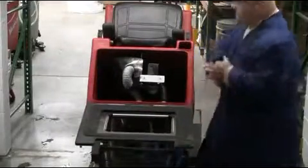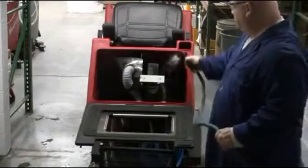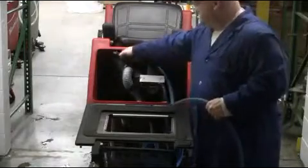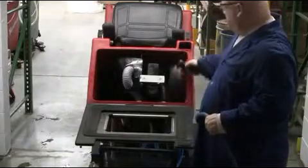The tank is safely supported by a safety lanyard. Next, open the recovery lid and thoroughly rinse the recovery tank with the drain hose in the open position. Once all the dirt and debris has been cleared from the tank assembly, replace the tank in the upright position.